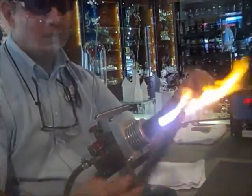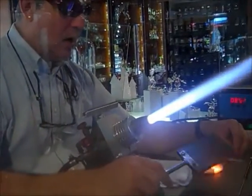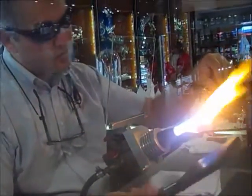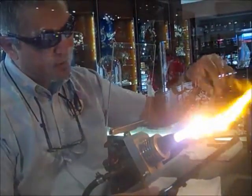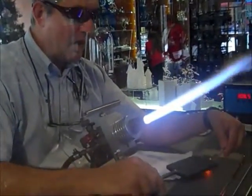The piece of black item there that you're working with — what is that? That's graphite. So just a graphite pad? Basically to retain the heat so it doesn't chill the glass. Because of this glass being a hard glass and the temperature being so great, you don't want to waste any of that energy.